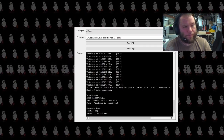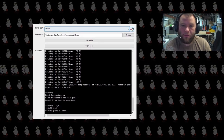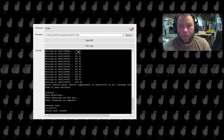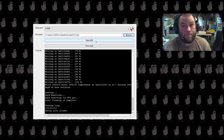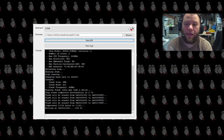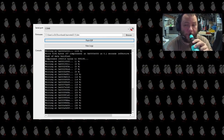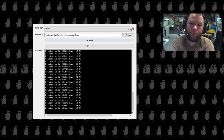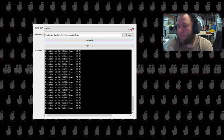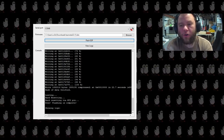Open ESP Flasher. I've already flashed one in testing, but my device plugged in should be COM6 since it's in programming mode. Specify your tasmota32.bin file, and if everything works, hit 'Flash ESP.' It should detect the chip, erase it, remove any Chinese malware, and flash the firmware. It appears to be flashing — take a sip of beer. It only takes a few moments; it's about 1.3 megabytes.